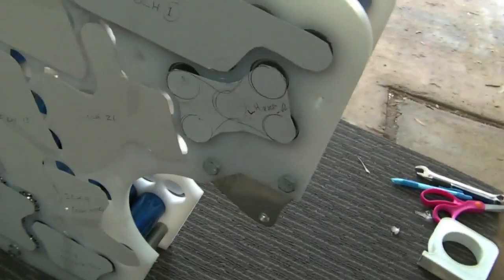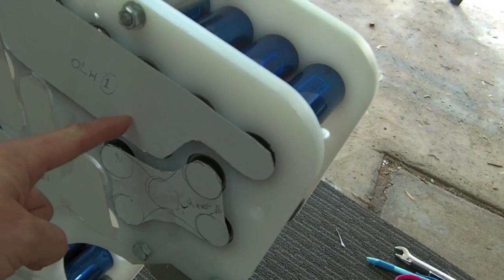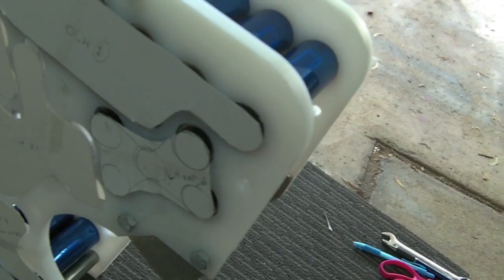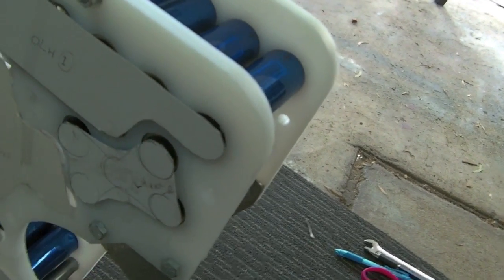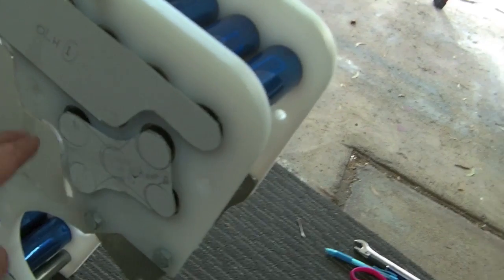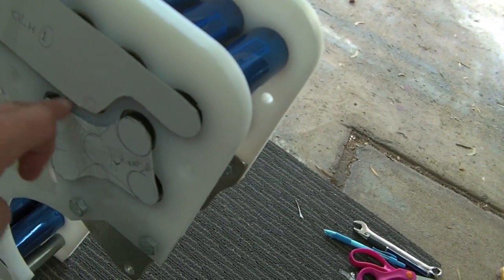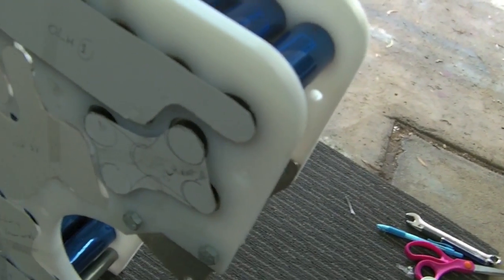That does mean, however, that the potential difference between this plate and that plate is 69 volts or whatever — one cell off maximum voltage. So I might be building a plastic ridge up here to keep those plates apart, to make sure I don't put my screwdriver across multiple plates.